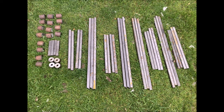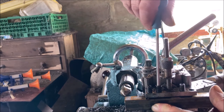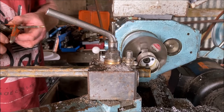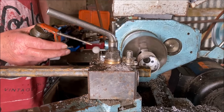A kit of parts was cut from 20mm square box section to form the end ramp structure. Short pieces of 40mm round bar with a hole through the centre will form the hinges. Accurately cutting the rounded shapes at the ends of the square bar was achieved using a hole saw mounted in the lathe. The top and end of the bar are aligned with the centre of the tailstock, and with a 40mm hole saw mounted in the chuck, the bar was fed into the saw at a slow feed rate, keeping the cut well lubricated at all times.